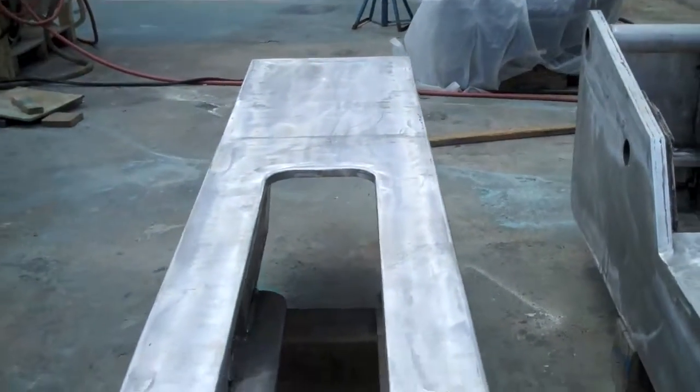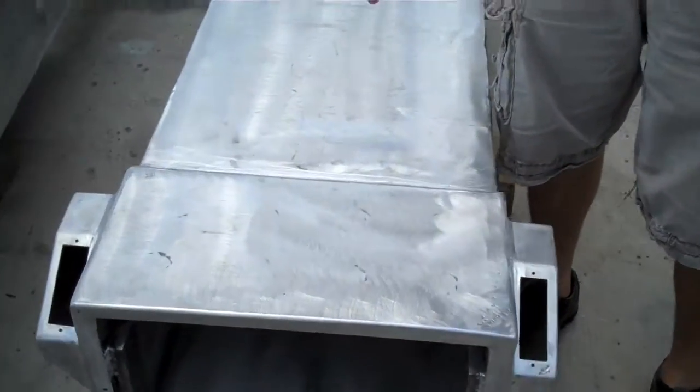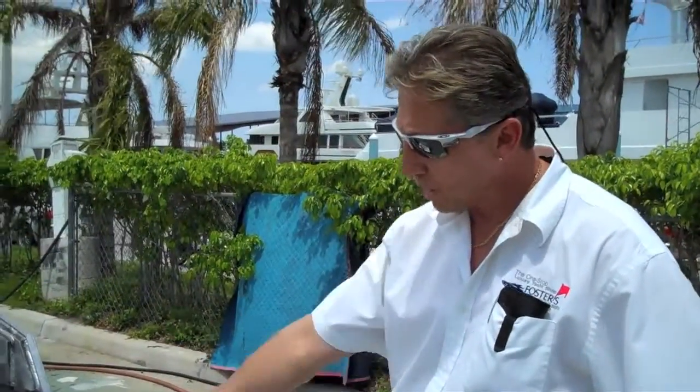So the whole key here is this is the raw form which you're seeing right now, and the whole key is to get this into an anti-corrosive protective primer. You don't want to build up too much or paint on the inside because one section has to fit into the other. You've got to be very careful you don't rip the paint off going back down to the aluminum and causing corrosion with salt water later in the future. So the whole key is to make sure you've got a good zinc primer on here.